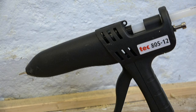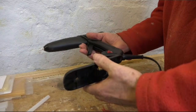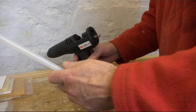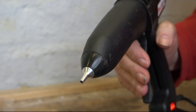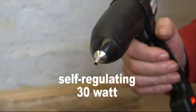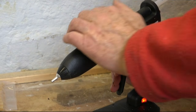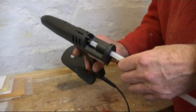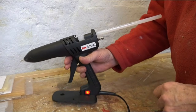In this video I'm going to explore the various uses of the glue gun, which makes it an essential piece of kit, certainly in my workshop. The glue gun is essentially a heated chamber through which glue sticks are fed via a trigger. This particular glue gun heats up very quickly and the trigger action delivers the glue consistently and rapidly via the nozzle. The first point is to get a glue gun powerful enough to deliver the molten glue instantly. You can see the sleeve mechanism that provides the feed of the glue stick, and the nozzle diameter is just right for delivering the melted glue.